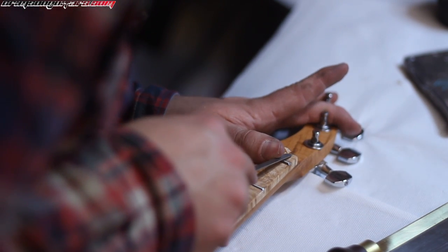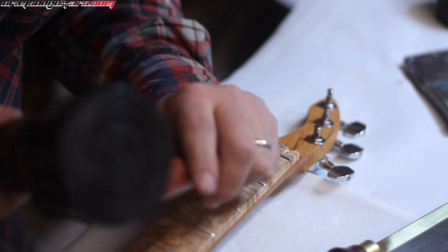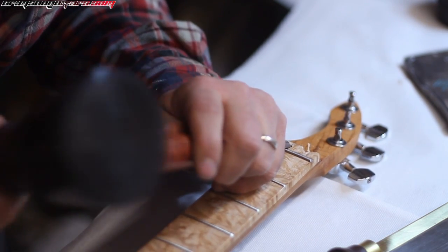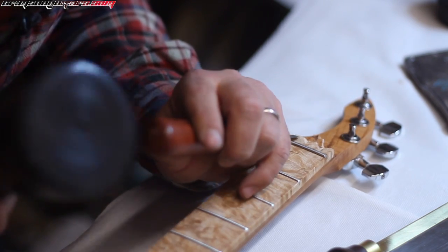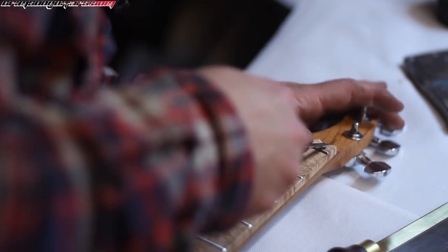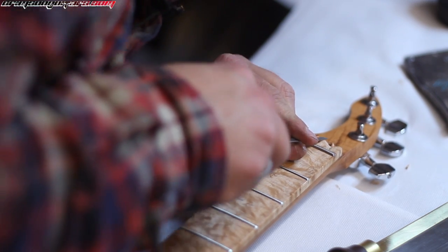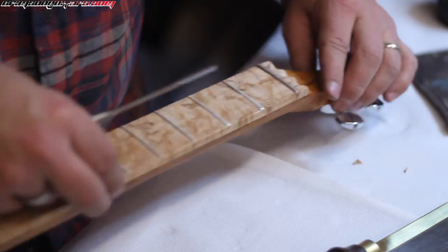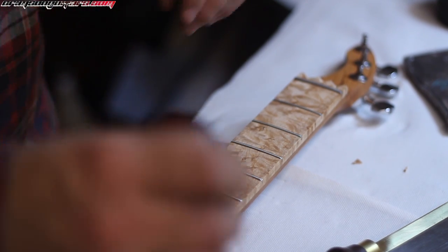I'm just going to notch that out. Now if this doesn't work at all, I can always put a more traditional nut on, or potentially something along the lines of a bit of threaded rod or bolt, which I've seen used on a lot of — what's this instrument I'm making called? It's a cigar box guitar. So I've now got my notches there and I can potentially string this beautiful thing up, except for the fact that I don't have a body yet. So time to tidy up and we'll get on with that.